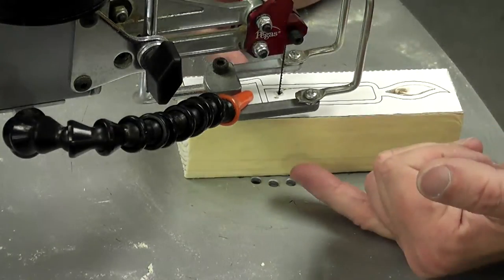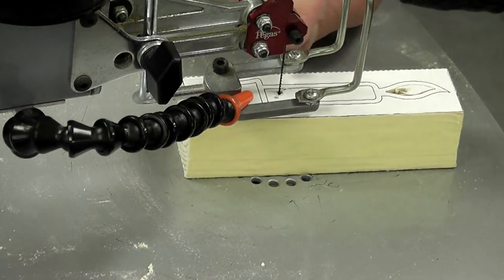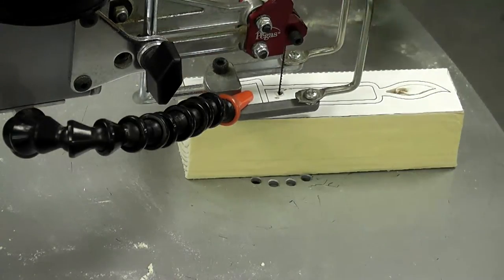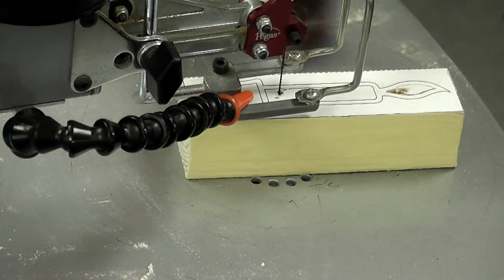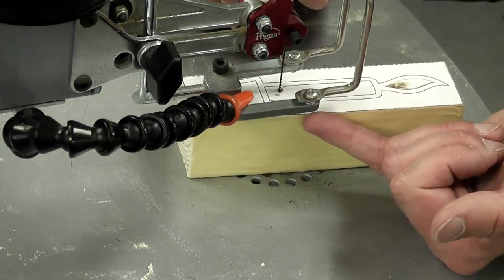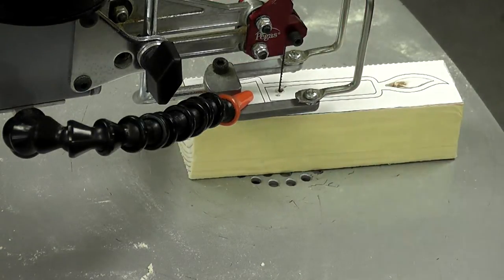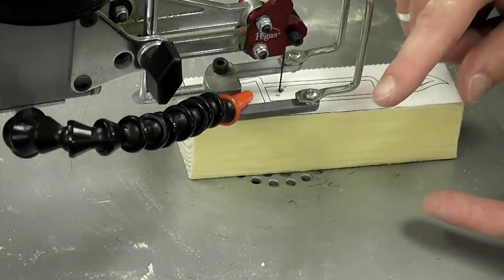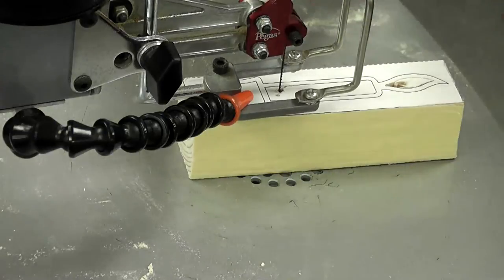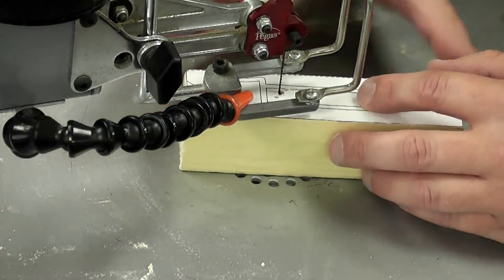While we're looking at this section, and I've just put the blade back on, if you're coming up to the max, like your 50 mil depth of cut, and perhaps your clamp head is hitting on your hold down clamp, just make sure you're holding the blade on its extremity, so the top and bottom. So you've got that extra few mil. If you've got perhaps 5 mil of that blade sticking out the top, that's 5 mil less that you can cut.